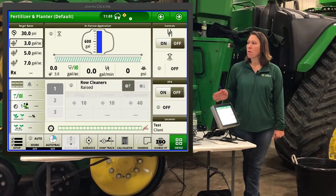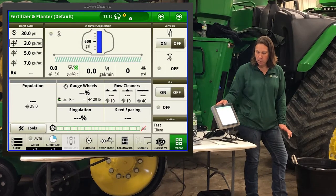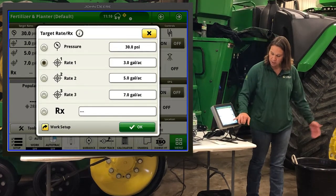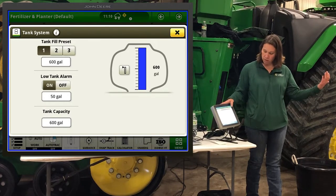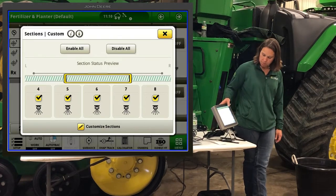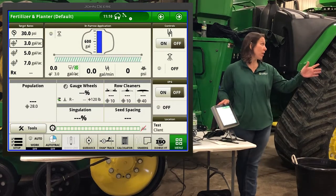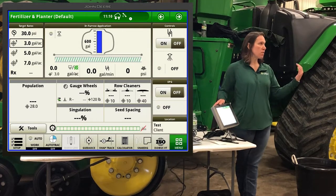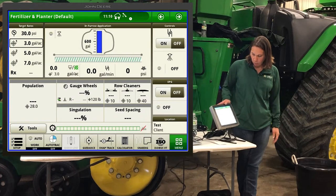This is our fertilizer page — kind of half planter, half fertilizer — for the exact rate view. You have a rate box to adjust your rates for your starter, set a preset and pick it. Inside here we get into the tank system app, and when you fill you just reset to full. Under configuration, make sure all your sections are on. This is also where you turn on your pump — it's all tied to your number one SCV. No extra hydraulics are required for exact rate, which is a nice feature of the John Deere system. It integrates with the planter raise-lower system, engaging when the planter is down on its height switch.